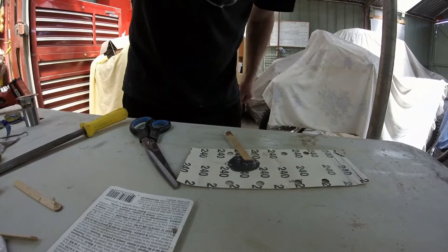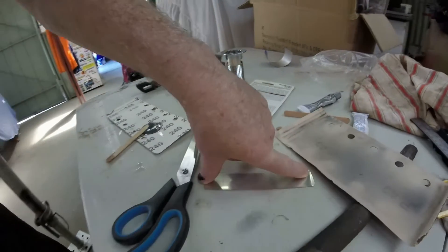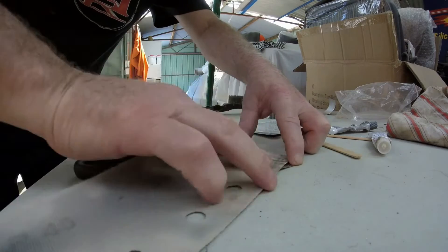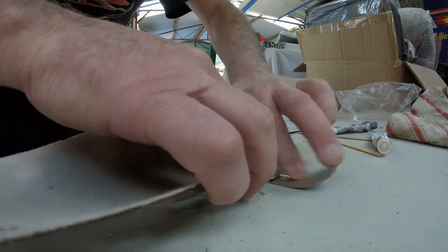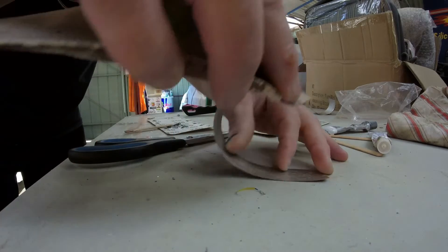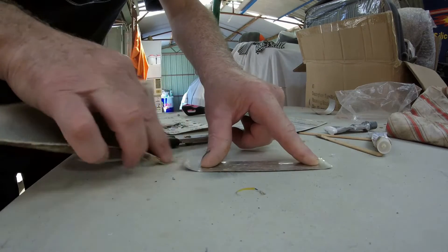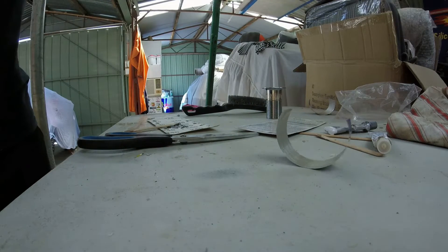That's mixed up now. What I'm going to do next is rough up the surface of this aluminium using 40-grit sandpaper. You want to be gentle because the aluminium is so thin — you just want to put some scratches in it, nothing else. You just want it to feel rough, not smooth, so the metal weld is going to take hold. Make sure you get your edges especially.